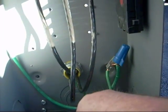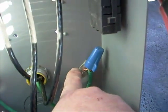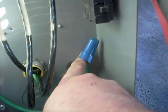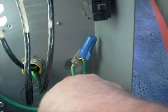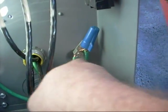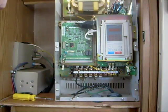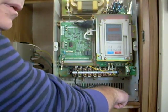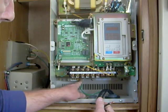I'm using flexible conduit because it's really easy and quick to install. We do have grounding wires which go from the electric motor and are grounded to a terminal here — a terminal attached to this can — and then this wire is joined to that wire. So there are three terminations: the ground and this green wire here from the motor, which goes to the variable frequency drive, just to keep everything safe. At the other end of the conduit from the disconnect we have the three wires and the ground wire, which I've connected to the ground terminal at the back of the variable frequency drive.